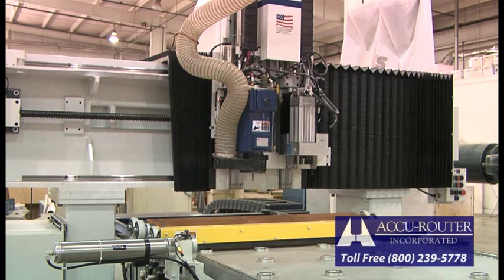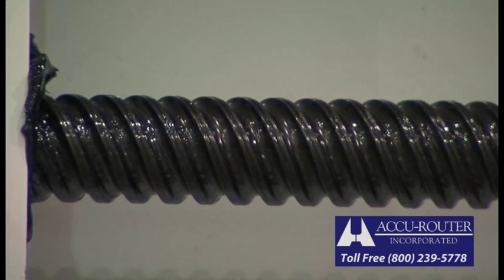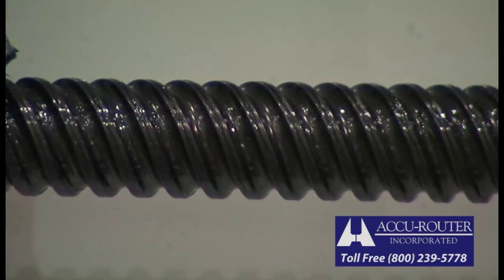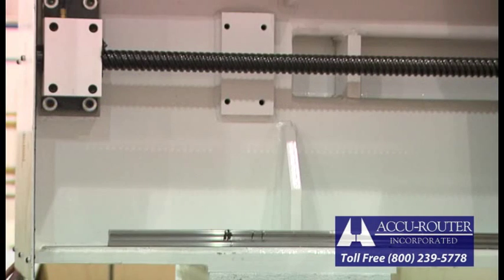The bridge was also redesigned to utilize three THK precision linear ways in lieu of round way shafts popular in the 1980s. In addition, the new bridge was converted to a high-speed ball screw. The bridge is extensively modified from the original. The Series 2 base also underwent the same design change, converting from round way shafts to THK precision linear ways and a high-speed 40-millimeter OD spin-the-nut ball screw. The Z-axis was converted to THK linear ways and a different mount.